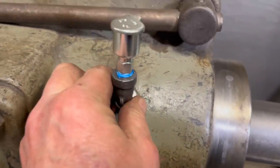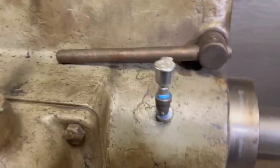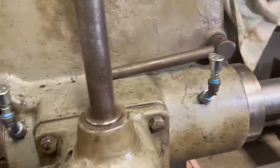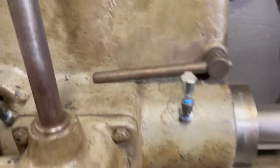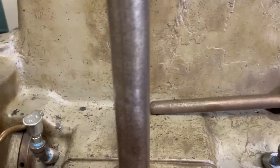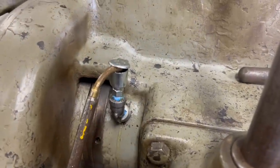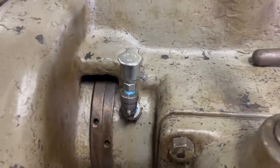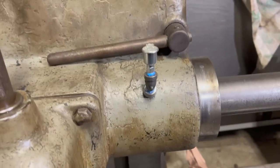I did cheat in a little taper so it's just a little bit of a press fit right at the very top — that's ideal. So I think we can go ahead and put the first oil in. How am I going to do this and hold the camera? Okay, just going to do it — yep, that didn't take very long, overflowed. But as the spindle is spinning the oil will get sucked down and do what it's supposed to do.